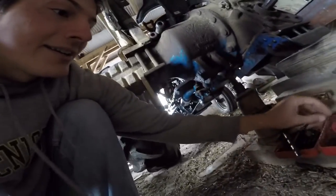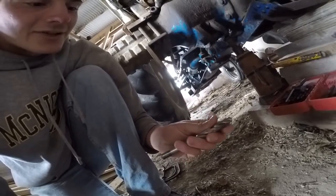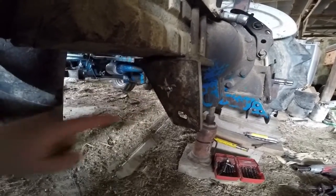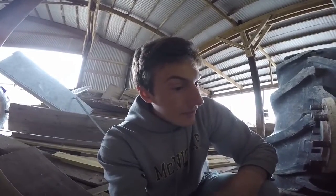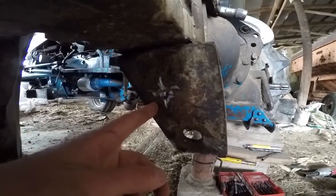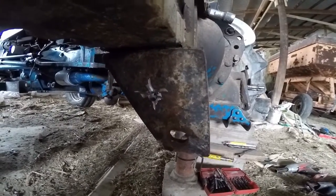Instead of cutting with the edge of the blade as you're supposed to, I was using the sides along the edge, more or less cutting down instead of pushing across and cutting off the edge. That took a while — I was making progress, but it took a while. Eventually I had the bright idea that somehow I could make a notch on either side of the drill bit. You can't see those notches anymore because I've drilled the hole out to half an inch, and this was back when the hole was only 5-16ths.